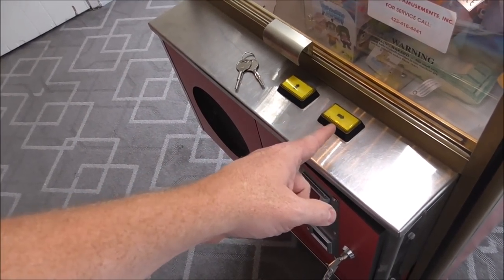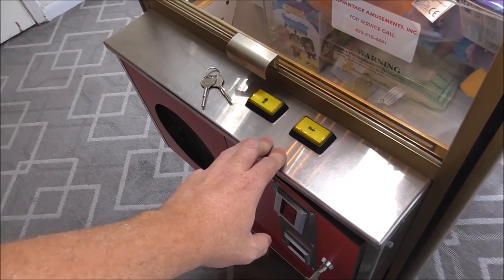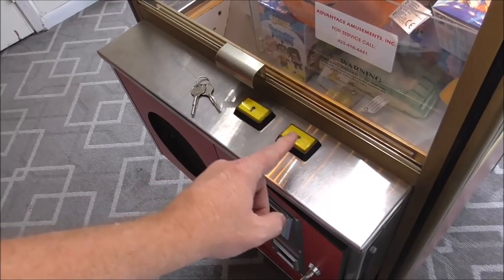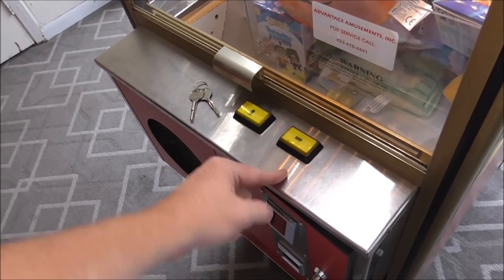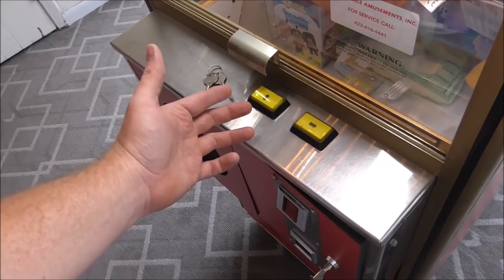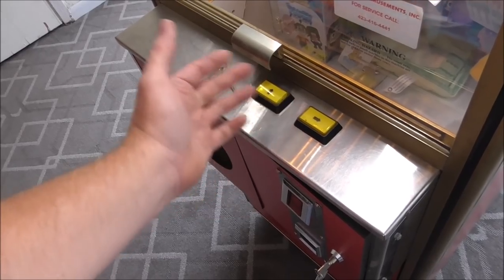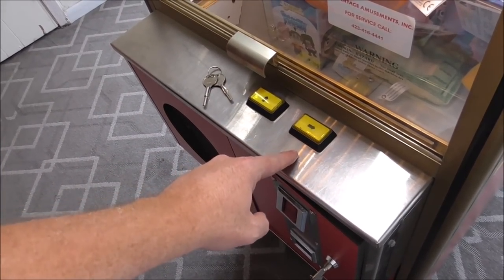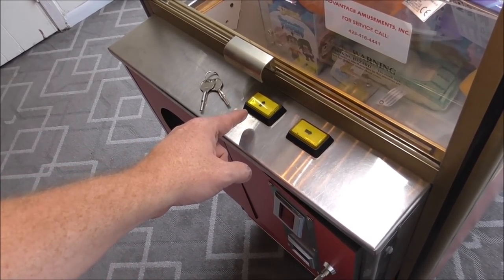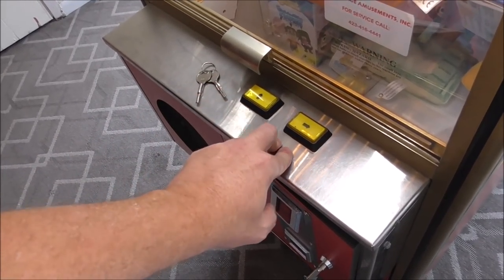You saw that. Now, this one, the light would have come on, and that light would have gone off if they still had the lights lit up. So this one, the same thing is going to happen. As soon as I hit that, it's going to turn off relay 1, which was allowing this one to be energized. I guess that's relay 2, actually. You saw how we did it. But as soon as I hit this, once you let go of it, you can't hit it again. It's not going to let you do it.